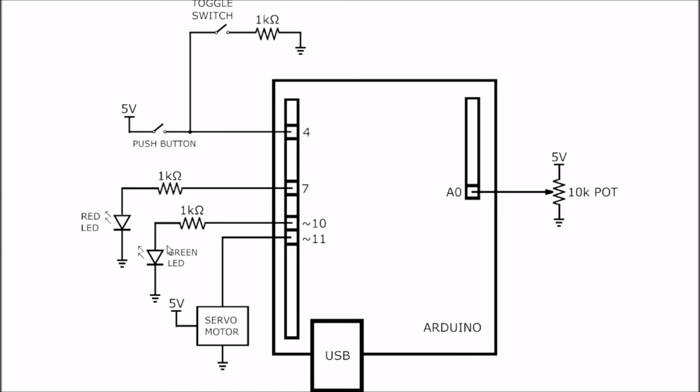And then I've got over here pin 11 on our Arduino board. Again, this is also an output PWM pin, as you can see over there. This is actually port B pin 3 on the Atmel chipset that's been used, with PWM OC2A, and that we will be using to control servo motor position.